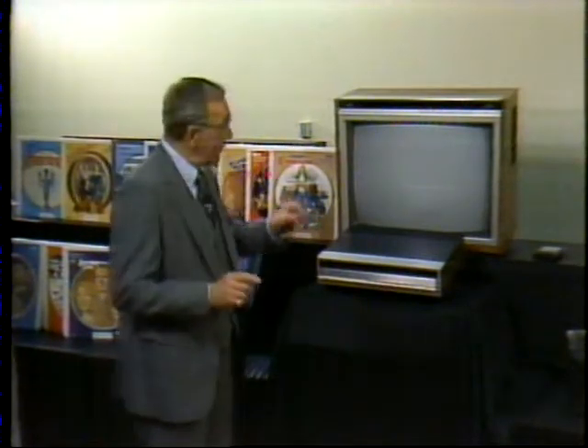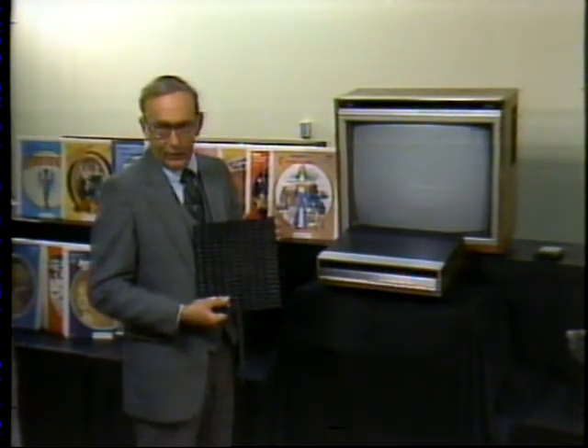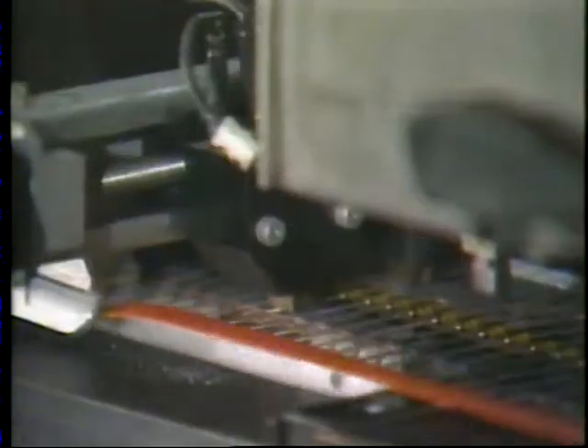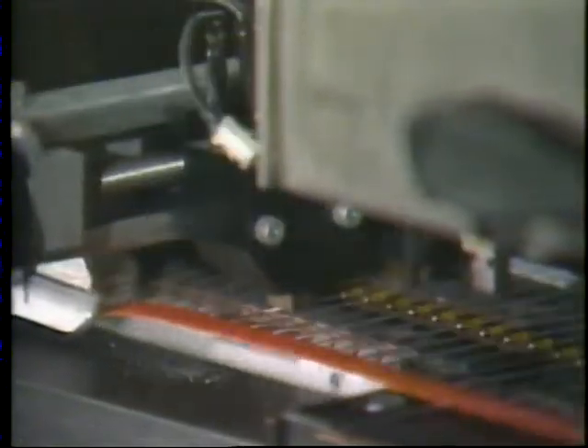The random access model has the capability of finding any one of several thousand images recorded on our disc. It even generates a time display on the TV screen plus additional graphics. And, of course, it has to translate these groove undulations into a television signal, as well as into direct video and sometimes stereo audio signals. Remote control commands from this infrared hand unit must also be processed by the player, and the response must be instantaneous — which is why every diode and transistor is 100% tested before entering the player assembly area.